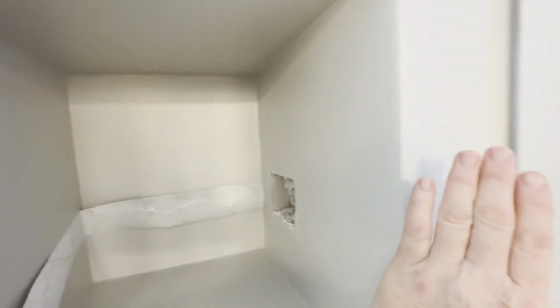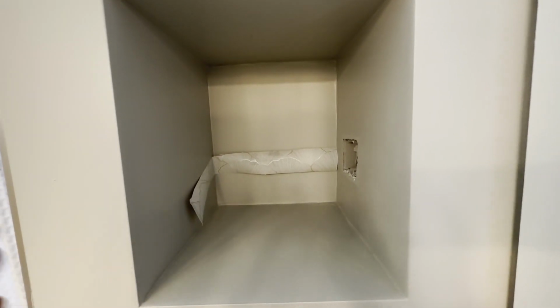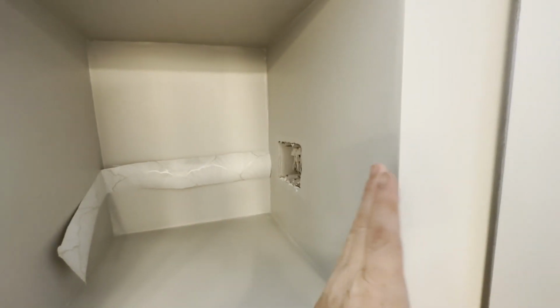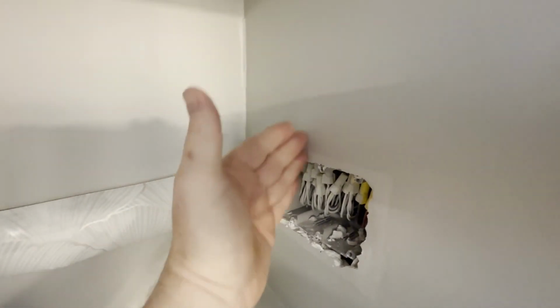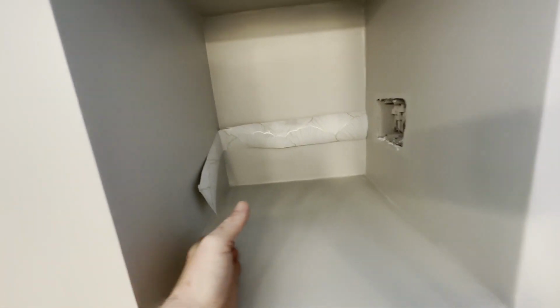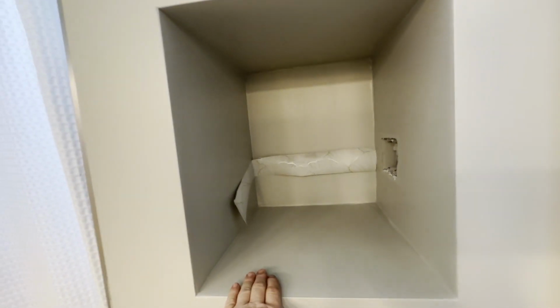And so the sheet that starts out here into the box is governed by, in my opinion, the principle of ease, of handling the connection between the first sheet that you bring into the box and the second sheet. You don't want it here. You don't want that. You want it somewhere. I usually say 4 to 6 inches, but in this case, I'm going to say 8 inches because this span is not big enough to fit my two arms in here and work. So it's going to slow me down. So that would be the consideration.